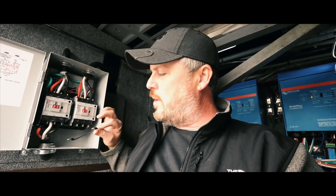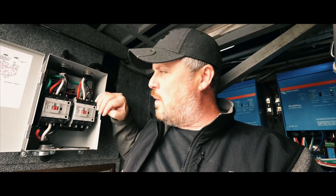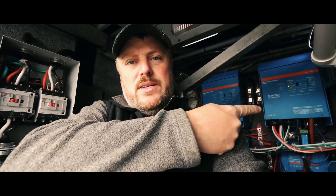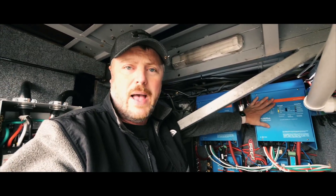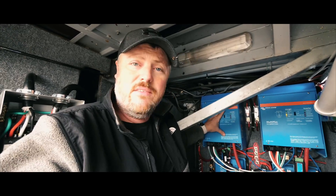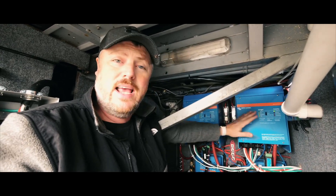Normally if you had a 220 generator, you'd have 110 coming in on one side and 110 coming in on the other side, and that would feed into your inverter system — because you've got 110 and 110. So now that line runs to this inverter right here, and it's the only thing that power comes from from my generator. When my generator kicks on, this is the inverter responsible for charging my batteries. This second inverter pulls power from the batteries, so because one inverter is pulling from the generator and charging the batteries while the other pulls solely from the batteries, I can still maintain 220.